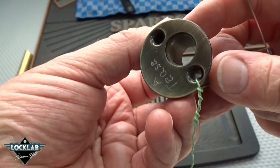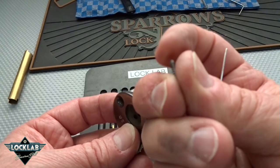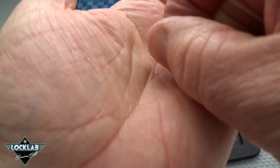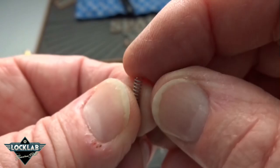Let's look at these springs now. In positions one and five it's just a regular brass spring. I'm really curious what's in two — that's what I'm after. I'm going to try to cover up all the holes except for two — I want to see what's inside. It's a steel pin and very, very stiff — hardly any compression on that guy at all. Position three is a tiny tiny little guy with almost no spring resistance.